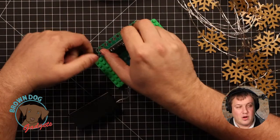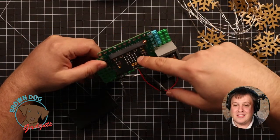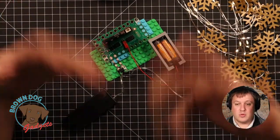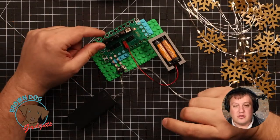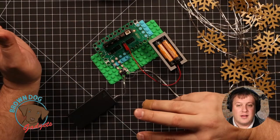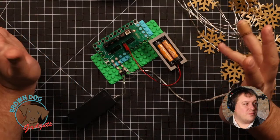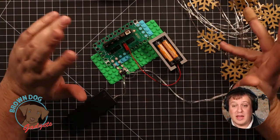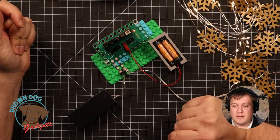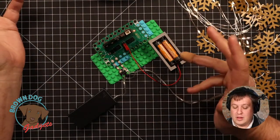For instance, the microbit has a built-in light sensor. It actually gets values from the LEDs and uses them as a light sensor, so there's no reason to wire in a light-detecting resistor, which we've done as projects. You can use the built-in light sensor to give you basically a light or dark rating. It's not a great light sensor, but it works. Is a room dark? Is a room light? If you want an automatic night light feature, for instance, light goes out, sun goes down, turn something on. Really handy.